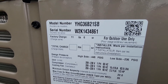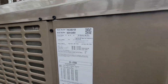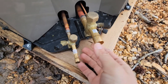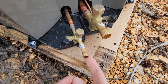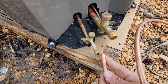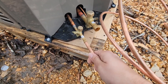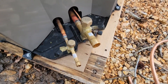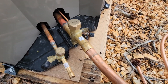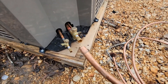Let's check out the sweat fitting for our 3-ton unit — this is a 36,000 BTU unit, YHG 36. For the liquid line it is 3/8". See that 3/8" copper tubing going right into that sweat fitting. And for the vapor line, or suction line connection, it's 3/4". You can see how that 3/4" copper fits right in there.